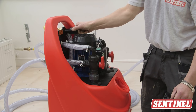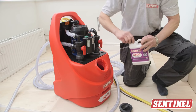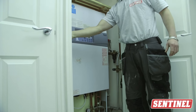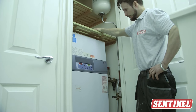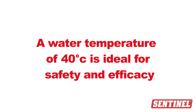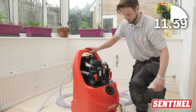Remember to adjust the inlet water to keep the tank level constant throughout this process. Close the dump valve and water inlet valve and set the machine into circulation mode. Add your cleaning chemical through the power flushing unit. If possible, temporarily fire up the boiler to heat the water, but don't leave the boiler running continuously — heating the water slightly will improve the effectiveness of the clean. A water temperature of 40 degrees centigrade is ideal for both safety and efficacy. Circulate the cleaner through the wide open system for 15 minutes, reversing the flow regularly.